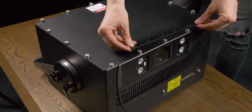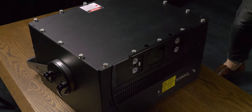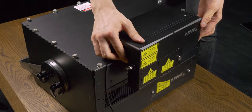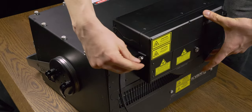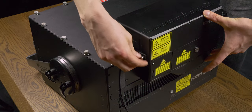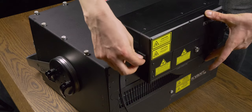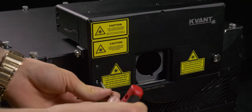Place the metal bracket over the three silver bolts above the aperture panel and firmly attach the optical bench to the new front aperture panel. Secure the optical bench in position with two small latches on the sides by flipping them all the way back.